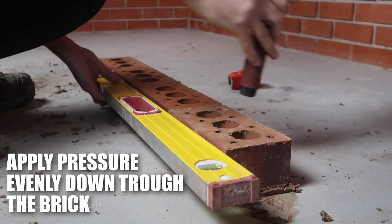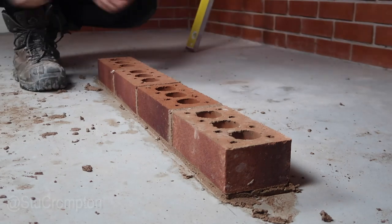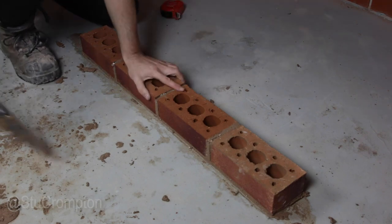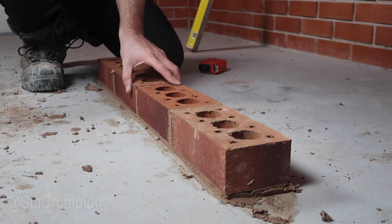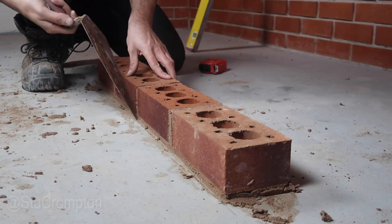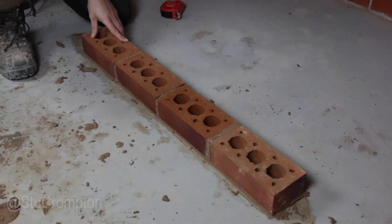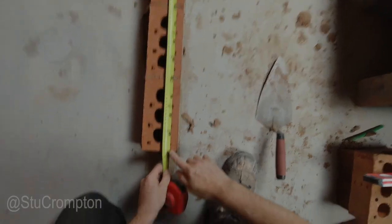And there we have it — that's our first four bricks laid, nice and bonny. Let's just check our brick length size. We should be 890mm and we are 895mm there — so a mahusive joint! If you need to tighten up, all you need to do is just pick this brick up and wiggle it down. A couple of wiggles, match the aris up again, scraping the excess off, back on your board. Same here — a couple of wiggles up and down so it pushes it out, match the aris up, scrape the excess off. Check your size again — we're 890mm there. That's belting.